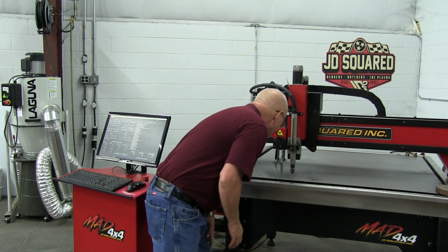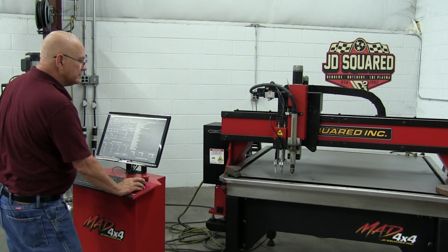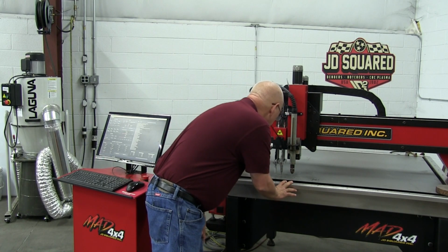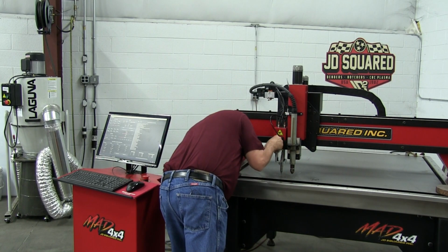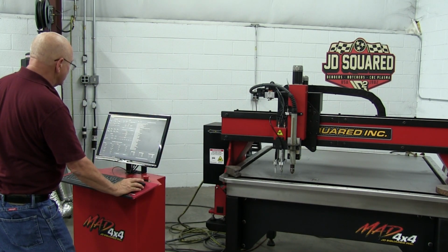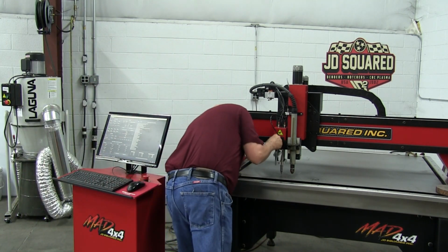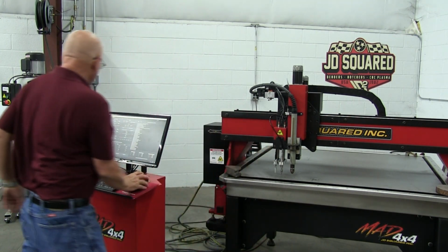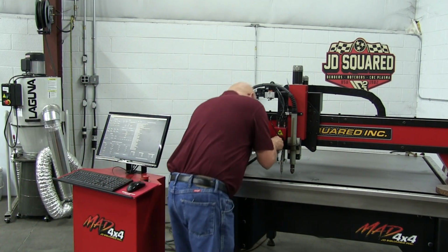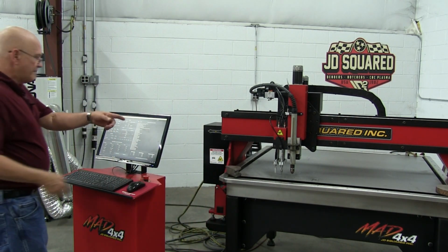I look at it. Looks like I'm to the right, maybe 30 thou, I'm guessing. Let's go 1, 2, 3 on the X minus. Yeah, it's pretty good. I can raise this up. We got to go this way on the Y plus, a pretty good distance, probably a good 100 thou. Yep, a little bit too far. Let's back her up. Okay, one final check. Looks pretty good that way. Looks good that way. Now, we're happy with the centering.